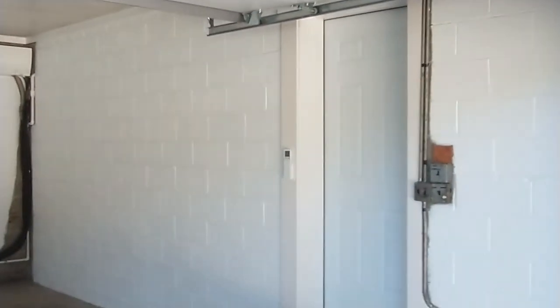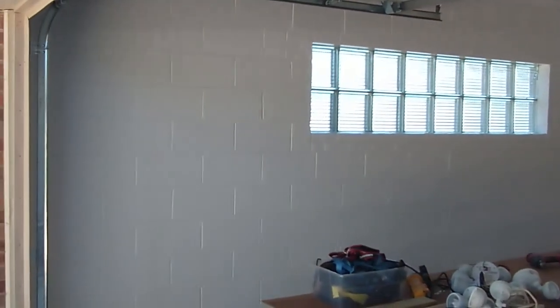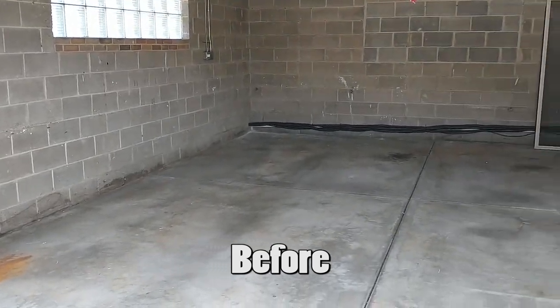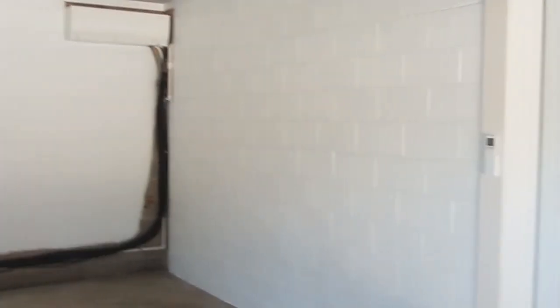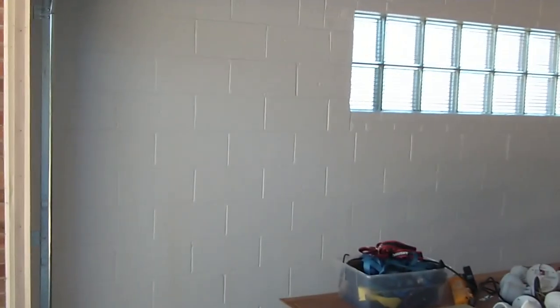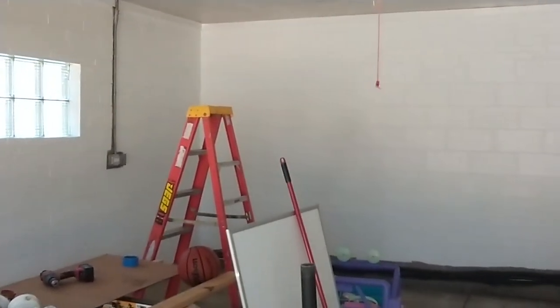In this video we're going to cover how I painted these walls white for a cleaner look that reflects way more light. This was bare cinder block and I slapped up nine gallons of block filler in two coats, then one and a half gallons of gloss white. I don't care what kind of garage surface you have - whether it's drywall, OSB, or cinder block - paint it white. It'll appear so much brighter, easier on the eyes, and require less lighting.